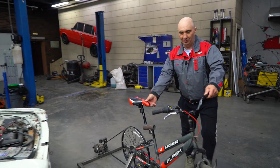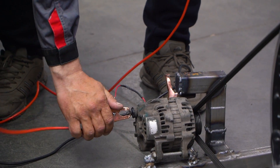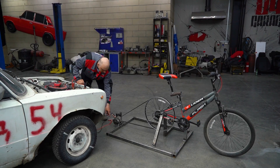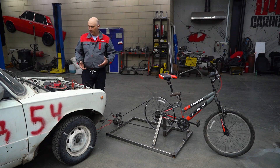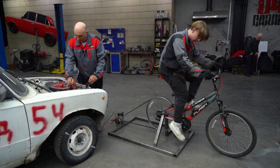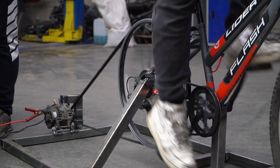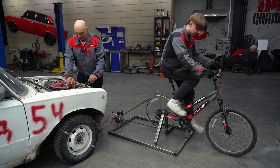Park it right next to our car. It's actually very light and convenient. Grab the cables — negative to negative, positive to positive. And in order for the whole thing to work, we need to feed 12 volts into the alternator for the voltage to create a magnetic field. We've actually got a wire right here — we hook it up to this. And there you go. Already reading 13.3 volts. So it's gone up from 11.3 to 13 volts with no trouble at all.